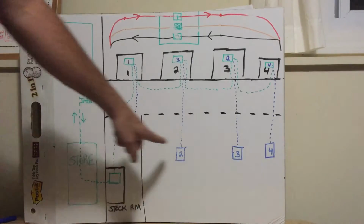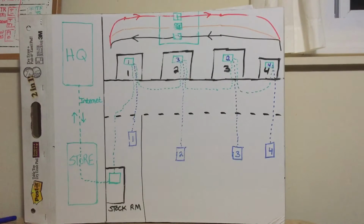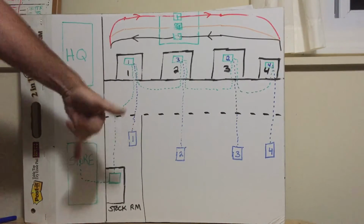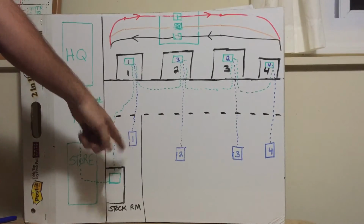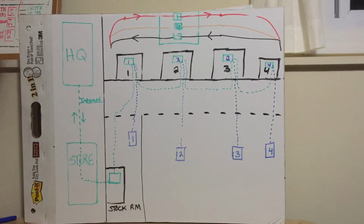This is another common mistake, the different zone sensors. If you assume that every one of these sensors was wired right, especially in a new store, you're in for a rude awakening, guys. I assume every time I walk into a store and there's a problem that there's something wired wrong, until I can prove that it's wired correctly. So what I would do is I walk into the stock room, I find the zone sensor, I disconnect the 3 wires to the zone sensor while I'm on the phone talking to EMS, and they say, hey, we just lost the zone sensor for number 3. And you say, well, I just disconnected the zone sensor in the stock room. Problem solved. Now you know what has been going on in that store. So use EMS as a tool to help you, but EMS's job is not to fix the units.